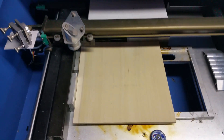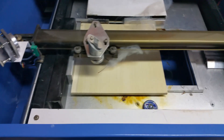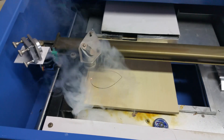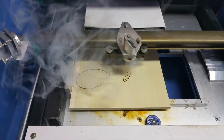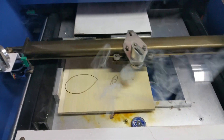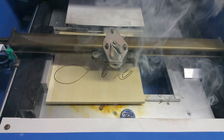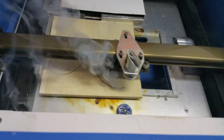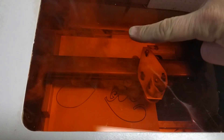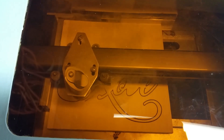Come back here to the machine and we're going to watch it cut. I'm sitting at about 50% on my power level but at 100% cutting speed. If you're wondering why I want 100% cutting speed — lower heat but faster speed — whenever you use a laser to cut you're going to have a wonderful smooth edge. I'm going to shut this so we can get the smoke to go out the vent in the back. The light above me is a little hard to watch it cut with.